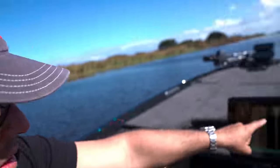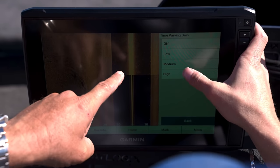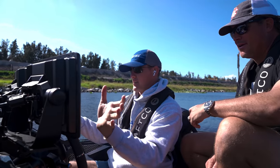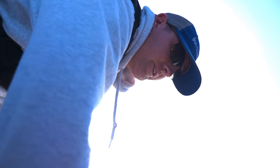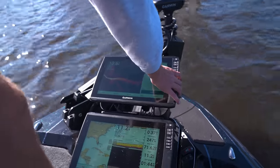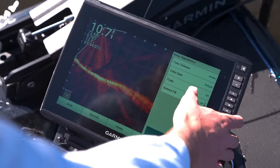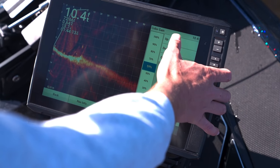This right here is a little hot, so he's turning the interference off and that cleans it up. You never want to turn on TVG - that'll make you unable to see your lure. Ghost reject I usually like on medium or low. Color gain - crank that up, I like that up high.